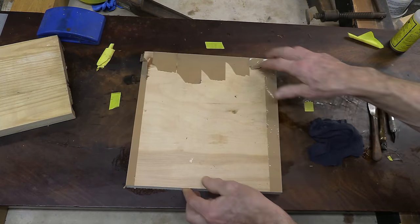Too soon to see really what this looks like. This is just water. I gotta clean off all this glue. It was also the old wood here around the break was dark, and I'm gonna treat this with oxalic acid at some point. Then we'll really know what it's gonna look like. Oh, there was a small little section of veneer missing there. I just patched that in off camera.